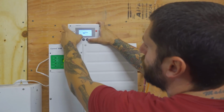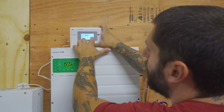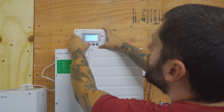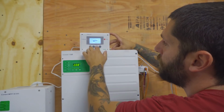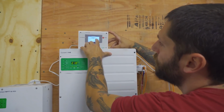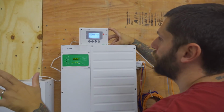And we're still charging. This is going on the battery. Right now in absorption. This is what I'm making right now on the solar. It's starting to ramp down a little bit because we're at 96% charge right now, so it's starting to slow down the charge. If I was to go ahead and turn something else on, my load would go up, obviously, and also the output right here would also go up and start bringing more charge in.